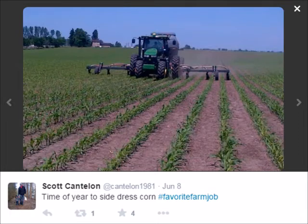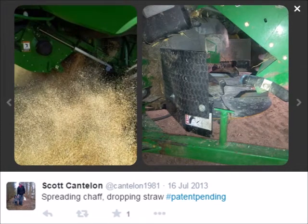We do sell some straw, which I guess is a little bit of a nasty, but there's such high demand for it, or people that expect to get it. One of our complaints with our green combine, we got a pair of 660s, has been the lack of ability to spread chaff when we're windrowing, and this is a chaff spreader. It's not just set up the way it is when we're spreading.